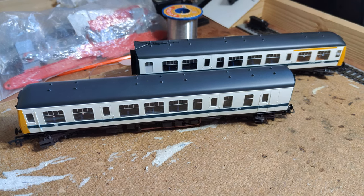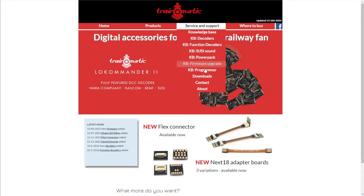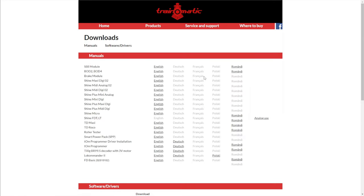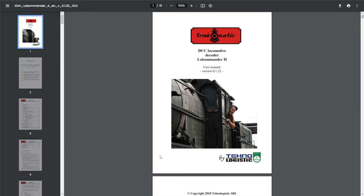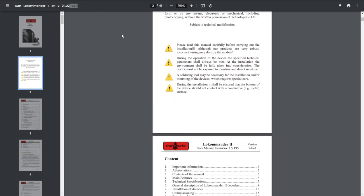In this model the decoder didn't do any of the things I remembered from before, and reading the two different sets of documentation I found, JMRI's config for these decoders isn't right — certainly not the old definitions I was using to try and set them up, and not the latest definition available now either. The latest is a much better definition, but it's still missing a lot of the ABC CVs and is using a mixture of both sets of documentation.